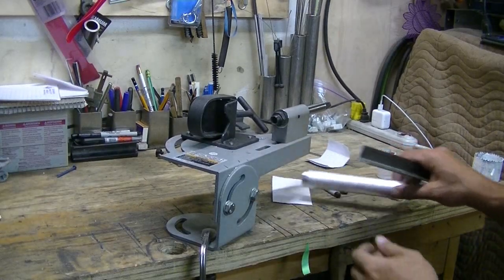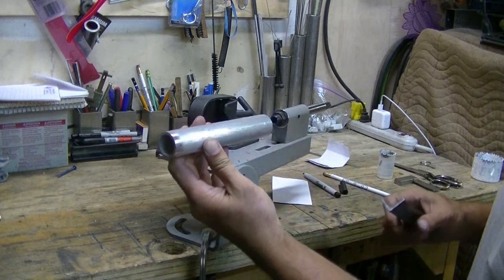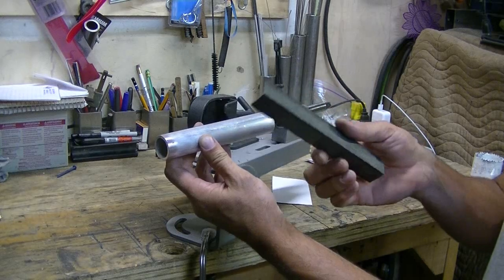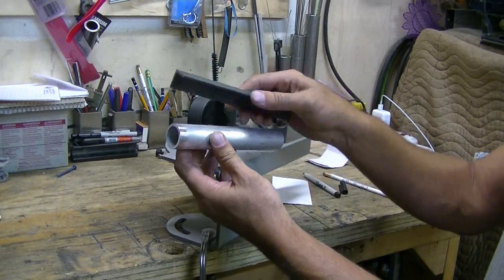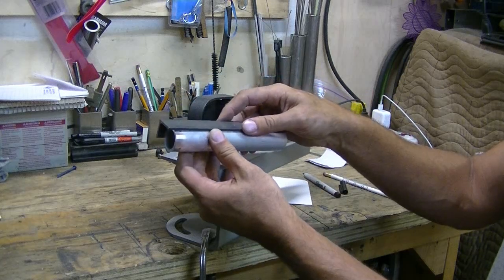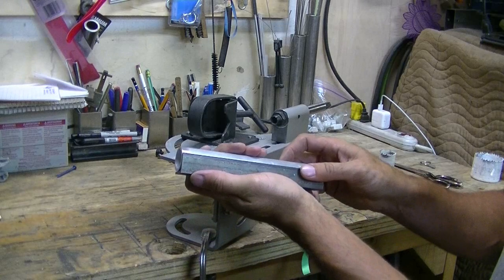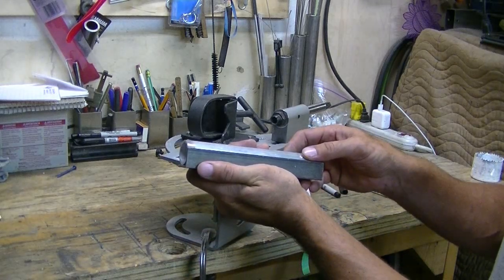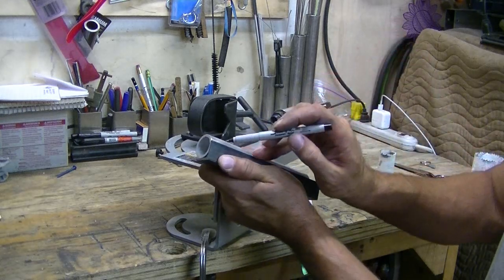Okay, so then to extend these marks along the pipe in a nice straight fashion in regards to its circumference, angle is one of the straightest things that's made that we can use to extend that line along the pipe. It saddles the pipe nicely and it gives us a very good reference point for what we're going to be doing here. Okay, I'll take the Sharpie and I'll extend those lines.